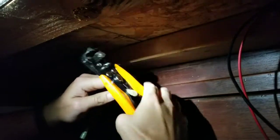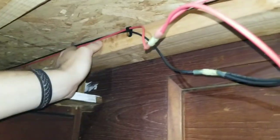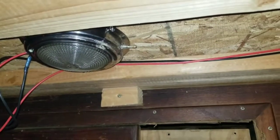I'm going to clamp this in. So what I'm going to do is I'm going to take these two wires and run them into that, install that, but at the same time I'm going to run these two into it as well. So that's going to be an interesting thing. First thing I'm going to screw this up into the bottom and then I will get back to you guys. Now as you can see I've got the one power line, two positive and negative lines running here to this light which is now wired in. Now I'm going to spool this up, tidy it up, and then drag it on through this way and install the desk light.